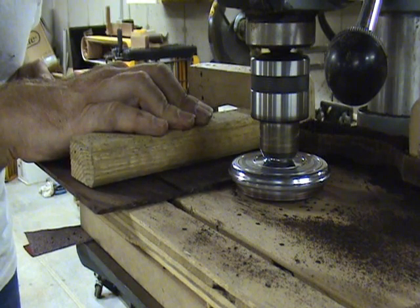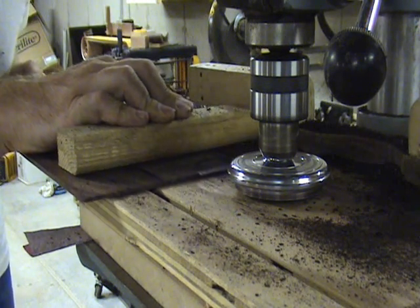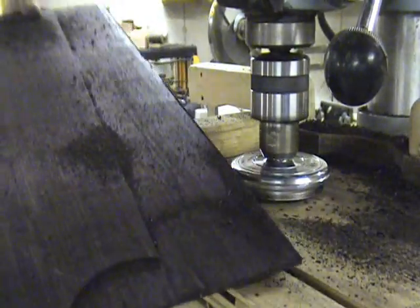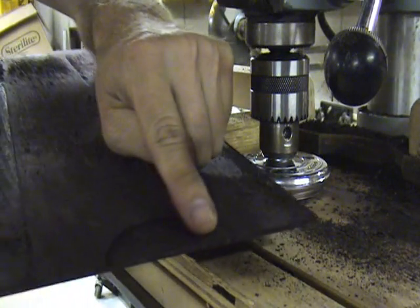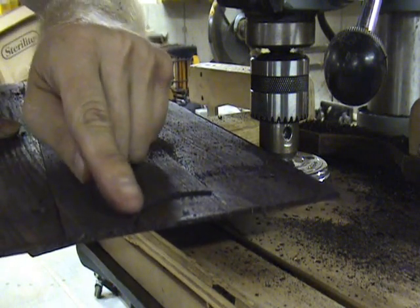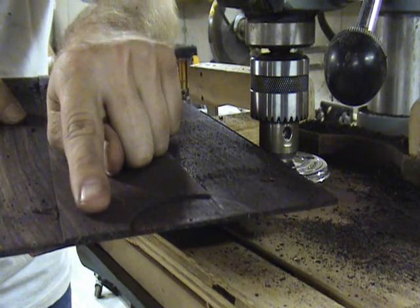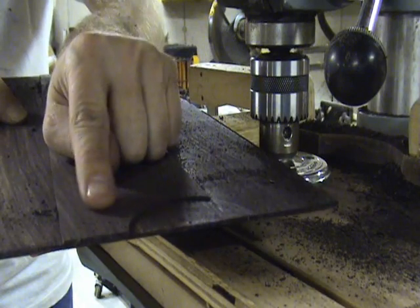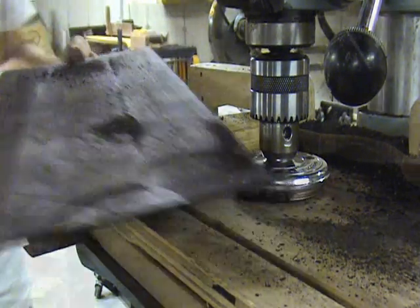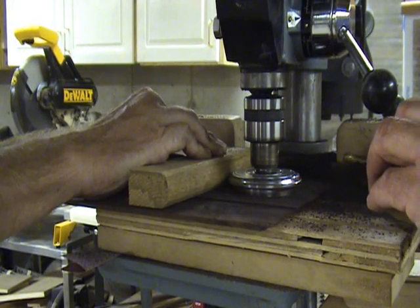I only slightly feed the piece of wood into the tool and check it with my calipers to make sure that I am still cutting at the same depth. You may need to adjust the table if there is a slight step between the first and second pass. Also notice that the tool is only cutting just over half of what is left to thickness.